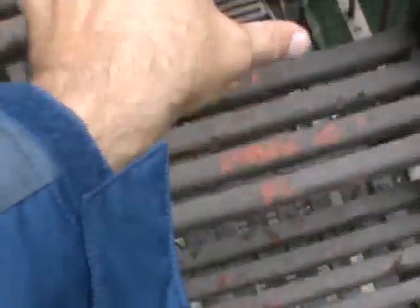Here's an example where we may fix and rebolt the tops, but as you get down to the bottom, these are bad. So 100% of these treads come out. These 2 or 3 treads come out, rebolt it, cut the rivets, new bolts, but you would never leave that in there. You got to make sure 100% there's no internalized rust. All right, I'm going to get to the next.